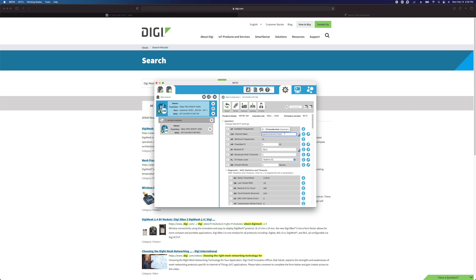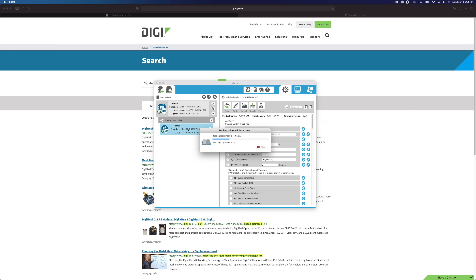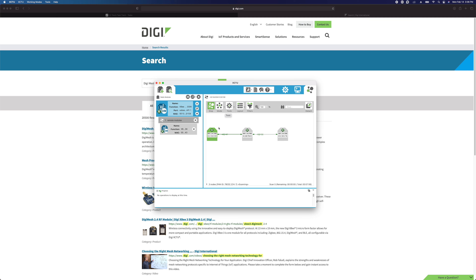That wraps up the main features. When we're all done, make sure to put everything back into run mode. The correct order is important: first change the router's network ID back to 7FFF and write that — because if you change the modem first, you lose communication with the router. Then go back to your USB modem and change its network ID back to 7FFF and write that. Keep in mind that if a sensor is back in run mode, it will never show up in XCTU. To analyze sensors, you need the modem, any routers, and the sensor all in configuration mode, because in configuration mode the sensor stays powered up and the radio stays active.